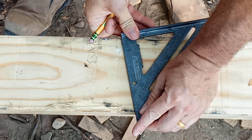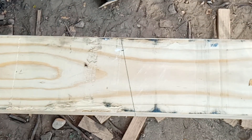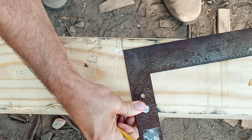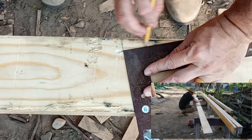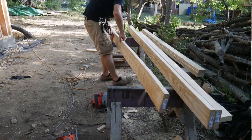The span between the beams is less than 5 feet, so I calculated that 2x6 rafters on 16 inch centers would be fine for a lightweight living roof. I had 30 rafters to make, each with 3 bird's mouth cuts. I got an assembly line going after a while — I would process 4 2x6s at a time, crowning them, clamping them together, and making measurement marks for all of them at the same time. Then I would draw out the bird's mouth joint for each board and cut the 4 consecutively.